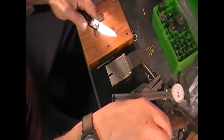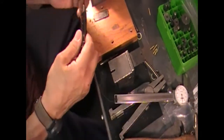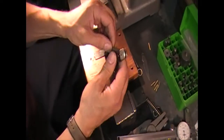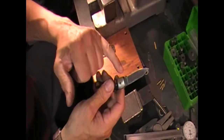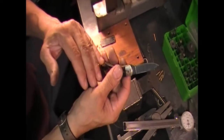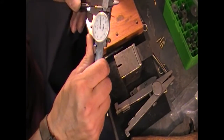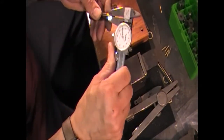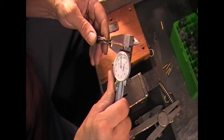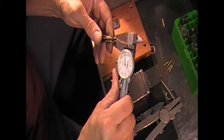Put your pin in. That's going to have a high point, but there's no problem. Once we get it all put together, we just grind the kick a little bit here and drop the point inside the knife where it belongs. Another thing you learn after a while is you really should have a blade that's a little thicker than the lock lever when you're riveting stuff up. This is going to be real close but I'm not too concerned about it.